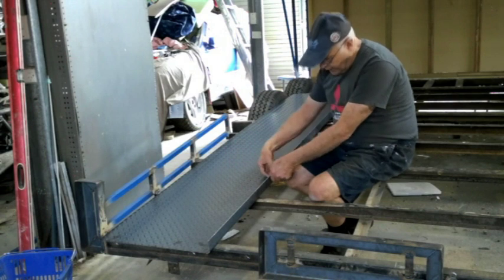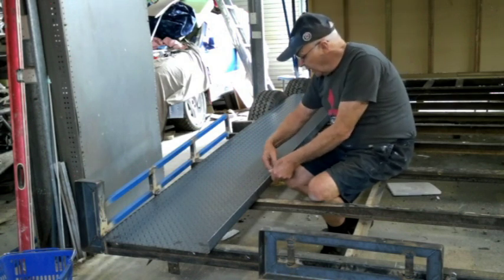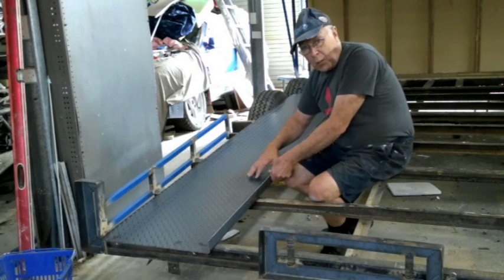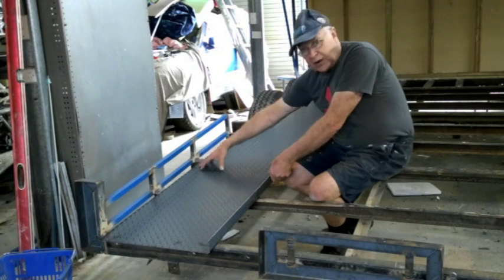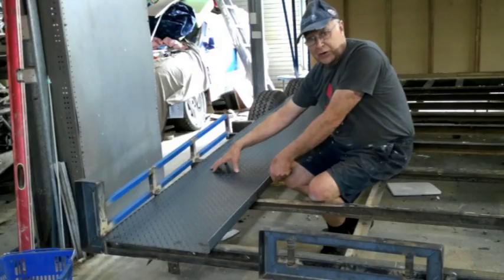The strips have got that 50mm lip bent up on the inside, done by the metal merchant, and they're 500mm wide, and that width means that I can put a wide variety of cars with different wheelbases and tracks on this trailer, with big tyres or little tyres. I reckon I could get anything from a golf car to a four-wheel drive on this.